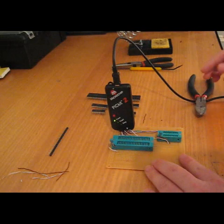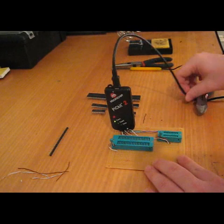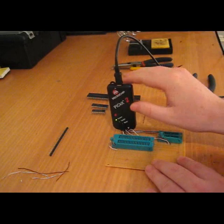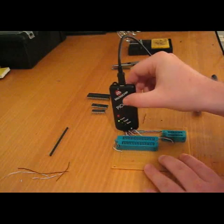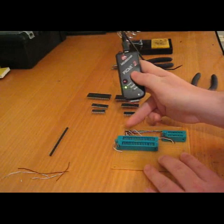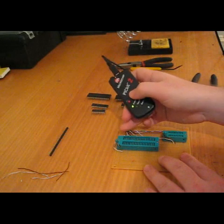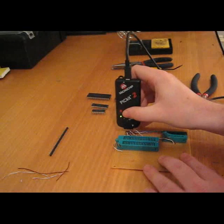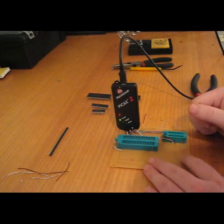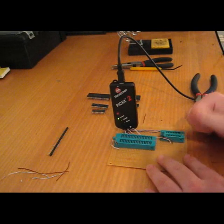It's all pretty much finished. I've got a pair of pliers here — use any medium weight. If your PICkit2 lead is running down and to the side, this weight will help keep the wire in a nice loop so it sits up vertical and isn't pulled in any direction. If you run into any issues, disconnect your PICkit2 and do resistance checks from your headers to your ZIF sockets — that way you can identify open circuits, which means a wire is around the wrong way or hasn't been soldered correctly. Hopefully this helps someone out. Once you've built this, you can program pretty much any PIC micro in the 16F and 18F range. Have fun programming.